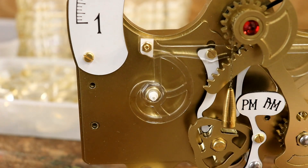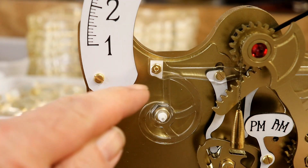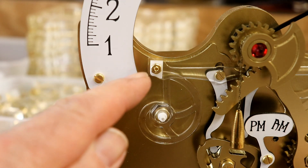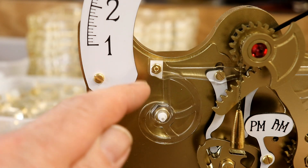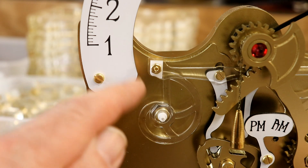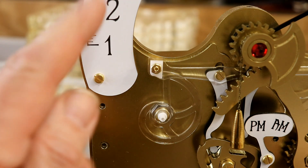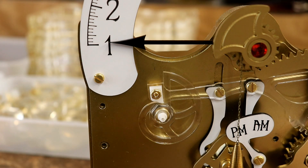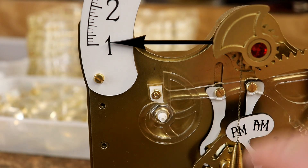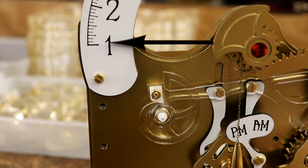Look at this - I hope to catch that working. It's meant to drop back right down. You can see I've now replaced the bearing, because it was causing some issues with accuracy. I've replaced that with a follower - and I'm going to have ordered some PTFE, which is that incredibly slippery plastic also known as Teflon - so I'm going to be cutting them out of that. I need to redesign this; not only have I redesigned and added the braking system, but now I've got completely bogged down redesigning this bit too.